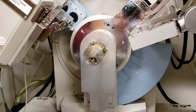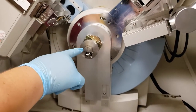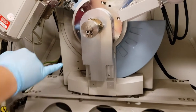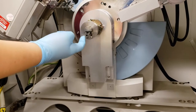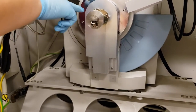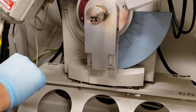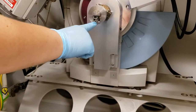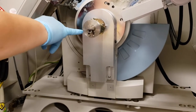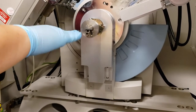This is the interior of the Expert system. Right here is where we are going to mount our sample. You can see right now there is a little clip installed underneath this semi-cylinder. If you have a powder sample, we are going to try to make a pile of powdered material where the top surface of your pile is even with the bottom plane of this semi-cylinder — a nice straight line across the bottom of the cylinder and across the top of your sample. If you have a solid sample, make sure it has been polished or ground down to a nice smooth surface.